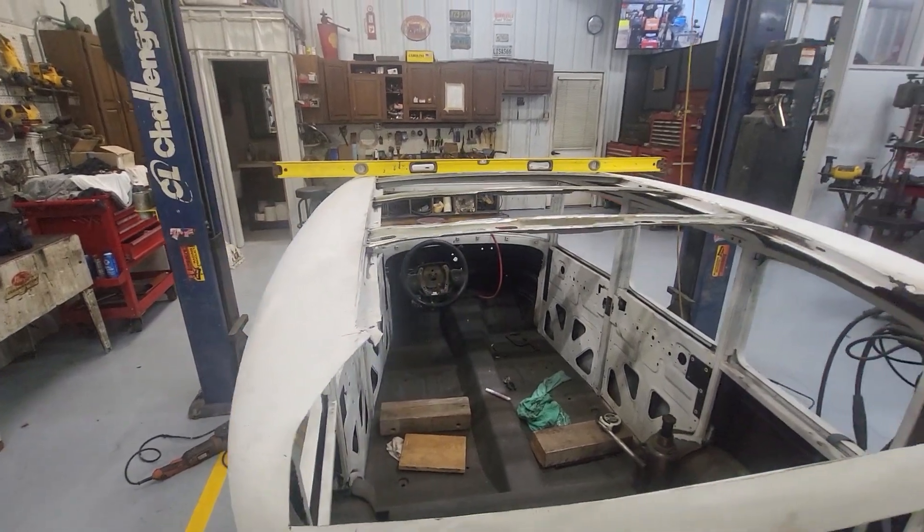We rolled this out and then I carefully cut it and filled it in. Yeah, it's going to need a little filler — I ran down with some screws and did a lot of tapping. I peeled away just a small amount of filler here from when I built out this corner — this was lead originally. I'm going to touch this weld with some fiber reinforced material and then come back with filler. I'm very happy with how this turned out — it looks good. Those grind marks are just because I wanted to peel the rust off and check the surface.